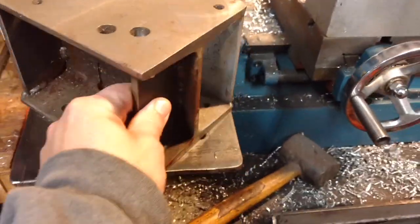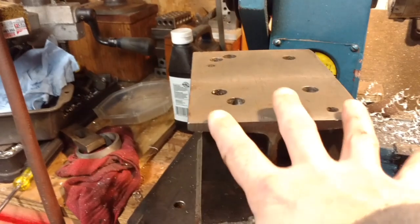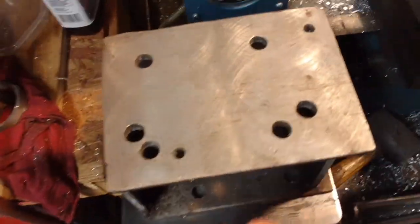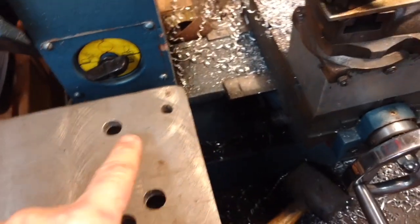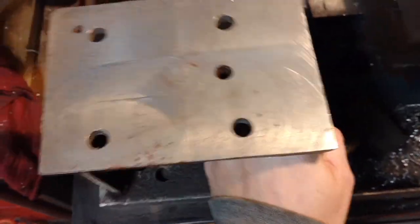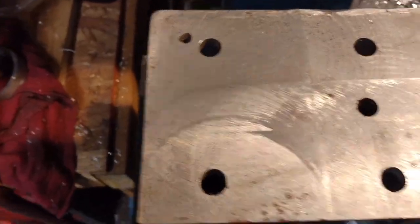So I started to make one, and I did make one. It was made out of a piece of I-beam — about five inches wide, about six inches tall, and about seven inches long. I put different holes in here for different ways of mounting, and then on the bottom just four holes to go into the table.